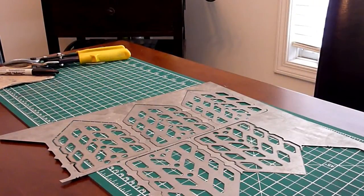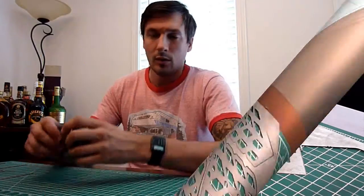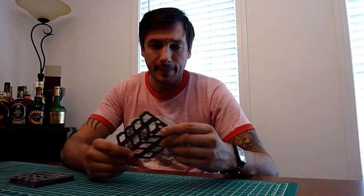The titanium snow stakes that you can purchase on the SLUK46 website are made from titanium 6AL4V sheet in a thickness of 0.016 inches, or 16 thousandths of an inch. It's put into a machine where a jet of water cuts the profile. When the water jet is complete cutting the profiles, I'm left with a number of pieces. I then take a piece of sandpaper and deburr all the edges because they're a little bit sharp. Afterwards, I mark the three spots where I want to put bends and I use a small press brake to implement these bends.